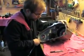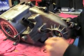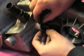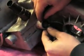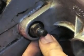You can see how it's supposed to be orientated in there, and that's all there is to it. Now we're on the other side of the case where the shift selector came through the housing. A couple of parts we've got to put in there. First is the O-ring — we're replacing this one with the new one. It just goes right around there, slides in. I'm just using my thumbnail to compress it in there. I want that to be a nice tight fit so we get no leakage. Leaks are bad — what's the point in putting it all together if you're going to have to take it apart to replace one stupid little seal.